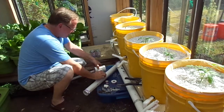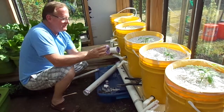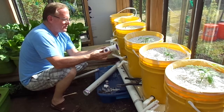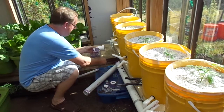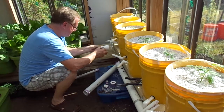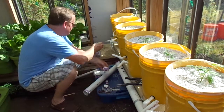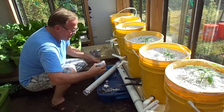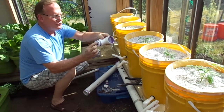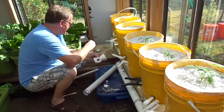The next thing I like to do is put on the tee. I've got a two-inch by inch-and-a-half reducing tee, and then an inch-and-a-half by three-quarter-inch reducer that will go inside here. It's already been primed. We just put the reducer on and push it in — that allows you to go from two inch to inch-and-a-half to three-quarter. Hold that for a few seconds and it's not going anywhere.